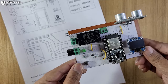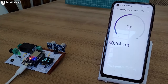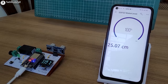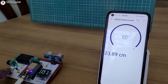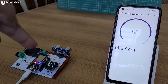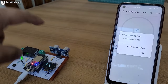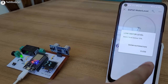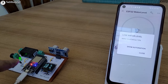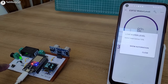Now before going to the details, let me show you how this project works. You can see the water level percentage on the OLED and the Blynk IoT app. Now the water level is slowly increasing. Now the tank is full. I can also press this button to reset the buzzer. Whenever the water level reduces, you can see the related percentage on the OLED. When the level drops below 10%, the level percentage is 7%. I got a notification in the Blynk IoT app — low water level. And I can also see the value, and the green LED turns on. Whenever the water level increases, the buzzer will stop automatically. You can also stop it from this button.